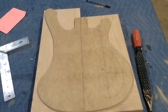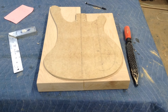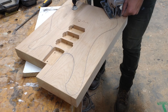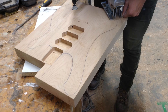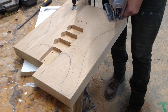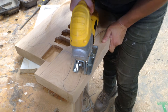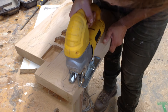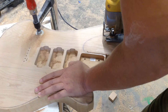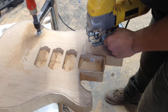He provided me with this template — it's just quarter inch MDF. If you need to make something like this it's very easy to make. You'd be doing the exact same thing I'm doing here but on the MDF to make the template: drawing on it and cutting it out with the jigsaw. If you don't want to do that, they sell these templates pretty inexpensively on places like Etsy. I'm going to use a pattern follow bit in my router to get the exact pattern onto this blank, but those bits are not really designed for removing a large amount of material.